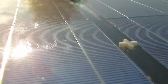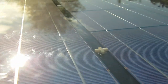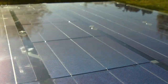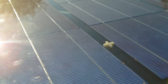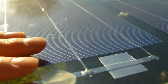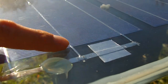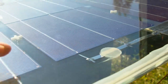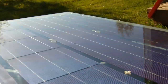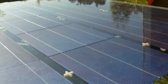What you can do with a panel for gas production is wire these rows in parallel. Each row here is 2.5 volts, so each row would be wired in parallel. This entire panel would then be 2.5 volts. You'd connect each row in parallel — the negative on this cell connects to the negative starting here on this row — and these would all be connected in parallel across the panel. So this panel ends up being 2.5 volts, which is perfect for electrolysis.